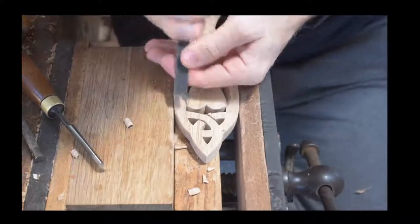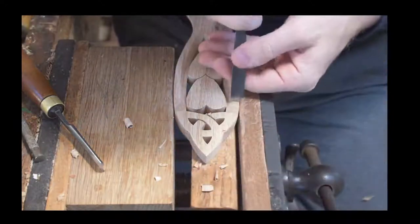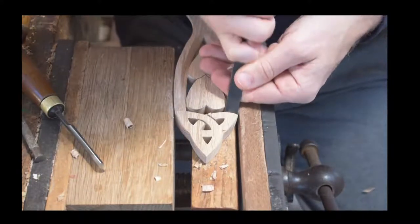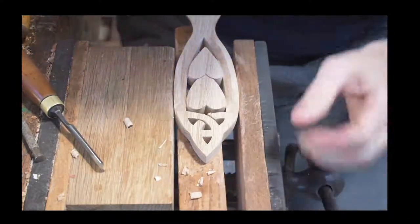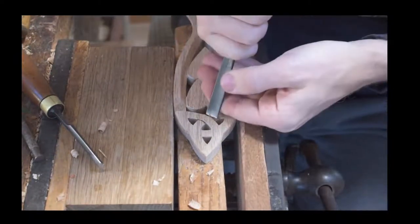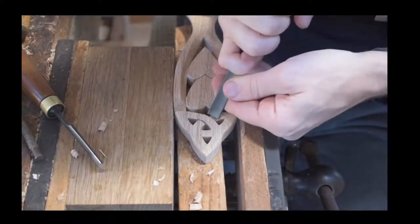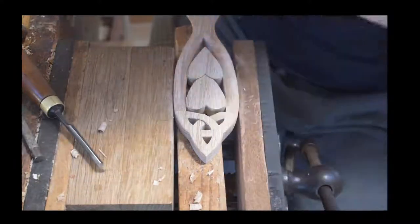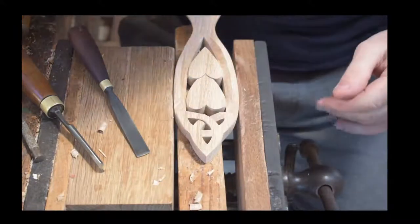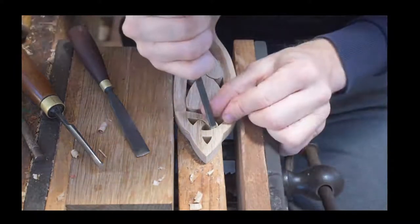As you can see, we're giving depth to the carving — we're actually removing quite a bit of wood from the surround. The surround is there to give strength to the design and to support it, but it's ultimately not the most important feature. The important features are the two hearts and that eternity sign — the idea of eternal life, eternal love. So we use that stop cut to create the effect of it going under and over, and we're going to do the same here.